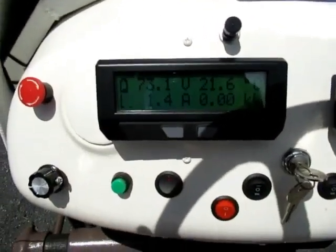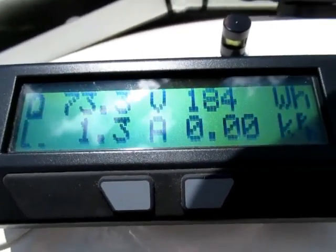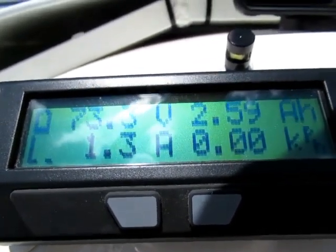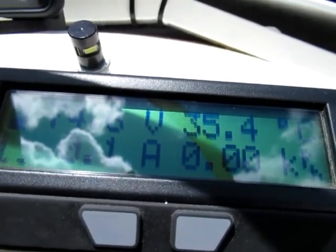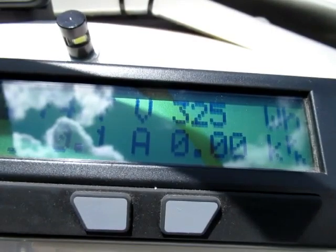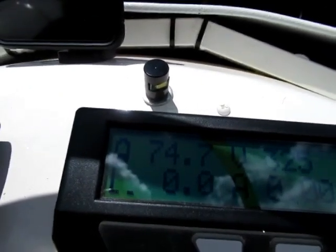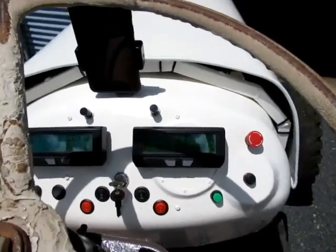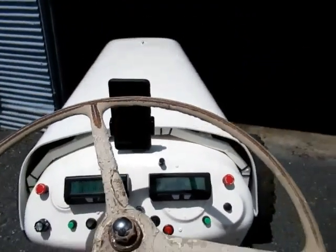If you look at the gauge now - this is the one for the PTO - hopefully you can see the screen okay. It says we've used 184 watt-hours on that circuit, the motor is at 21 degrees, and we've used 2.59 amp-hours. If we go across to the other gauge, we used 325 watt-hours, the motor is a little bit warmer, and it's used 4.57 amp-hours. Voltages are sitting at about 74 now whereas we were up around 80. Batteries probably have another 10-15 minutes of run time. But that shows that it does work and gives me some numbers to work out battery sizes. All in all, a successful run - hopefully you found that informative.